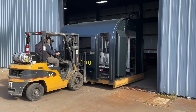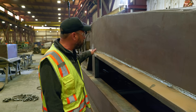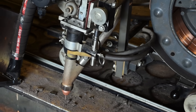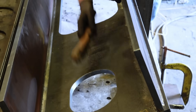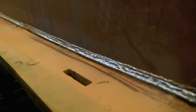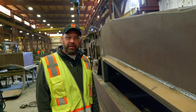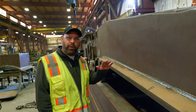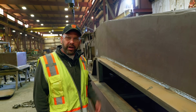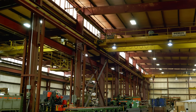One thing we get questions about a lot is the welding. All the welds use one of two methodologies. When we have a nice flat run surface, we use submerged arc welding — it puts down a layer almost like sand, welds inside that, and sucks the sand back up so there's no oxygen getting in where the weld is. It can be run hotter, penetration is deeper, and it's a more perfect weld — that's the preferred method. For curves, you can't set the machine up to do that, so it's welded by hand using metalcore weld, which is just as good. Afterwards, the welds are ultrasounded or radiographed to check for imperfections. The documentation file on this frame will be three to four inches thick of paper — every weld is documented: who did it, what machine, what the settings were, and when the weld was made.